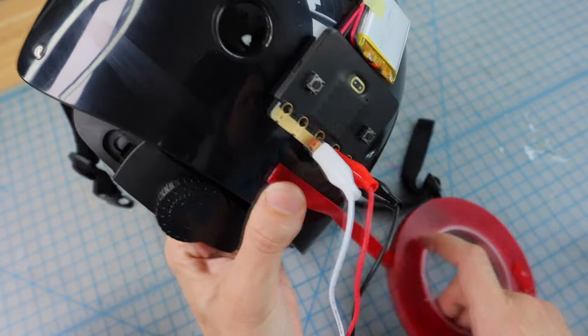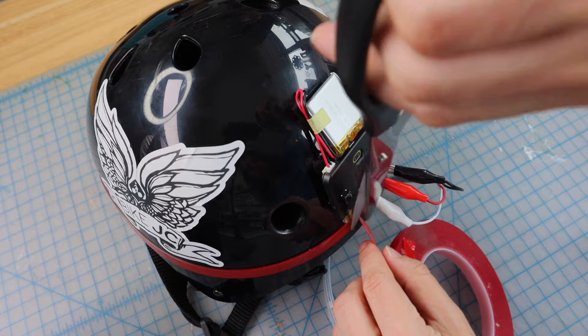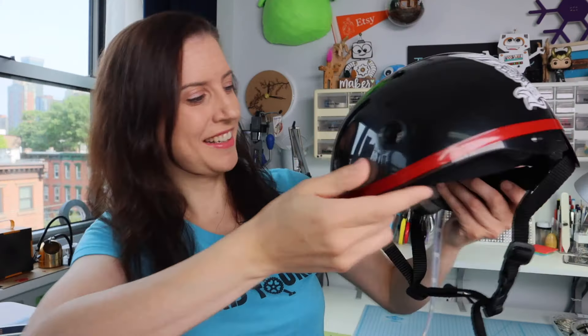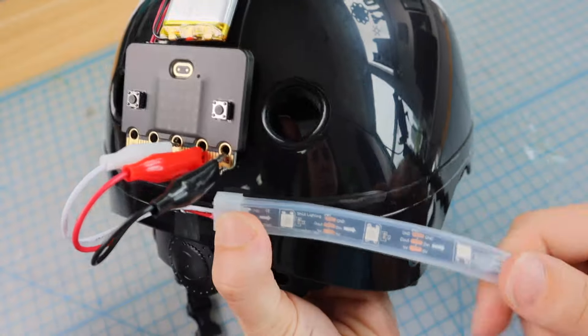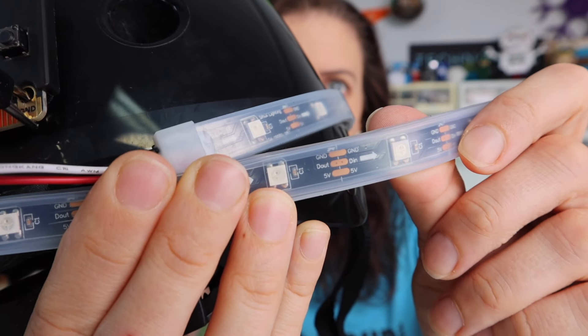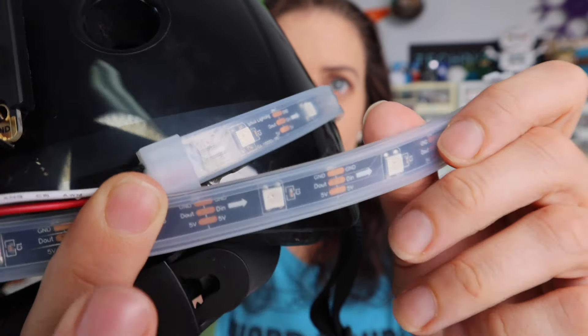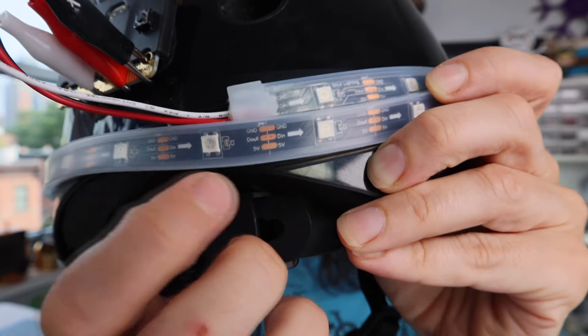Now that my microbit is connected to my helmet, I'm going to use some mounting tape to connect the LEDs. With my mounting tape on, I'm just going to press my LEDs onto the mounting tape. Now my LED strip is attached all the way around my helmet and I even have some extra. On every NeoPixel strip there will be three copper pads with a line through them — that's a place where you can cut. I'm going to cut here to make one complete circle of LEDs.